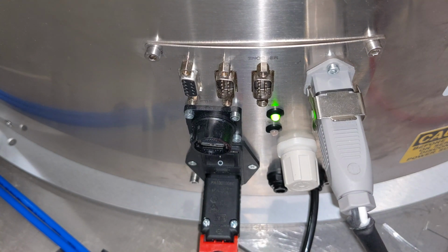The reason you would want to adjust this air in is because when you use the flipping functionality, which has 2 linear actuators underneath the bowl that push against the parts to flip and reorient them, there may be too much or too little air behind it, and the parts may not be flipping to the correct orientation. Okay, so now that you've set up the air, finally you want to connect the I/O.